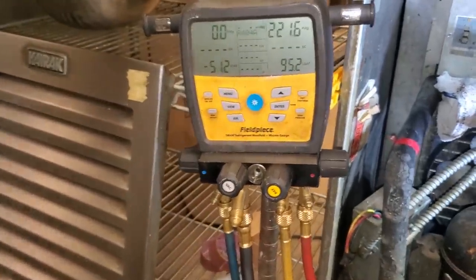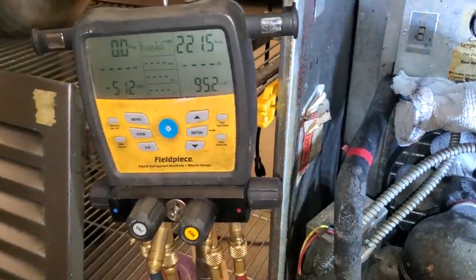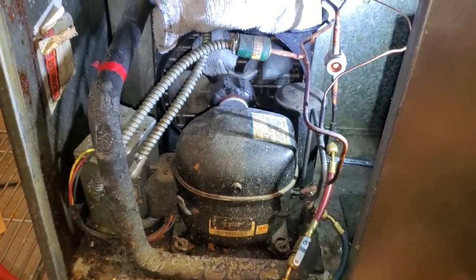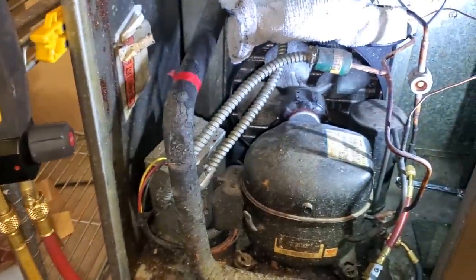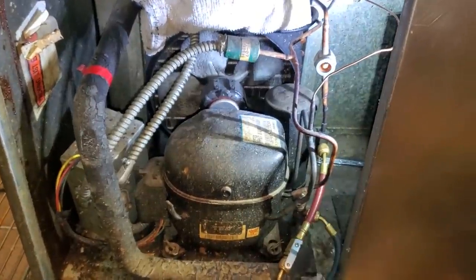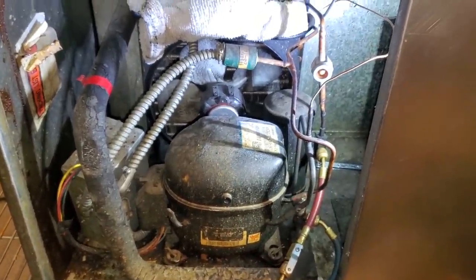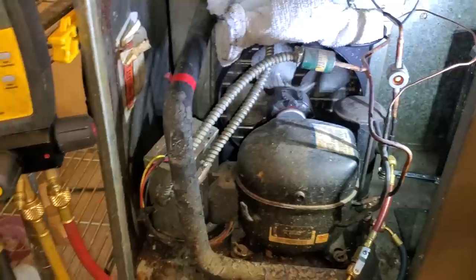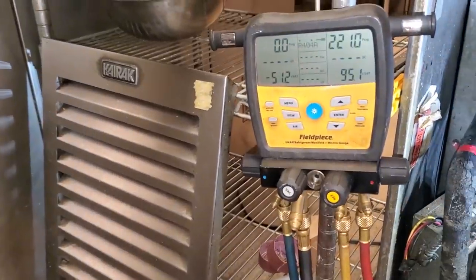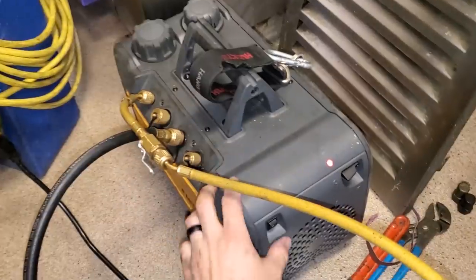This is one of those instances where I'm going to pull through my manifold. I know I preach proper vacuum and everything, but this is a pump down system that more than likely still has leaks. You're never going to pull a sub-micron, crazy low micron level vacuum when you have a receiver that's pumped down, because you're going to end up pulling through all the valves in the system. You just do your best, pull some microns, and you've got to make an educated decision.